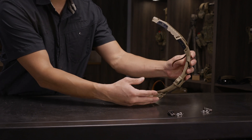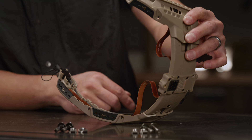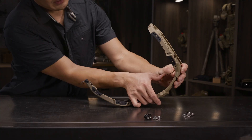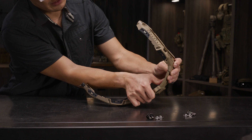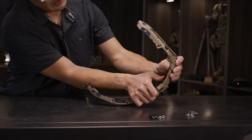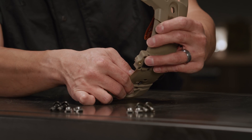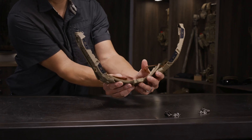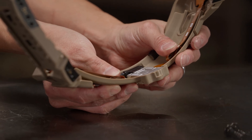Next, we want to shape the flex cables properly so that they will sit nicely inside the rails once Rail Link is mounted to the helmet. Properly shaping the flex cables will help avoid pinching them between Rail Link and the helmet. Gently push down on the cables on both sides, being careful not to flatten them all the way down and create creases in the cables. Now we've got the flex cables situated properly with a nice shape to each side without creasing them.